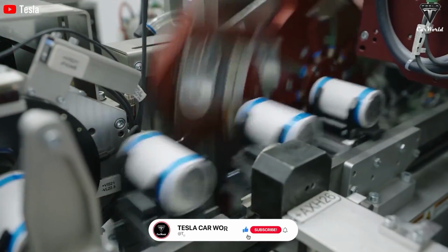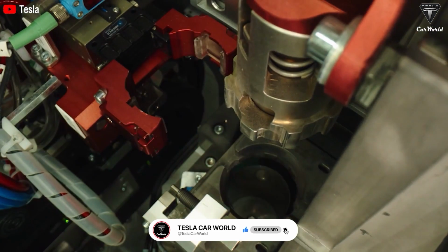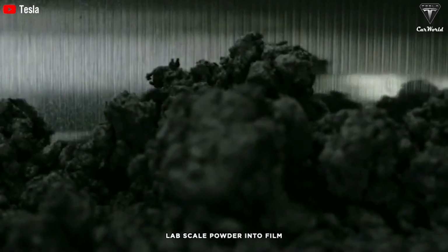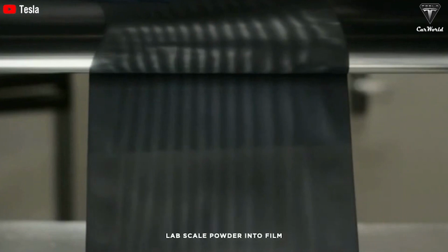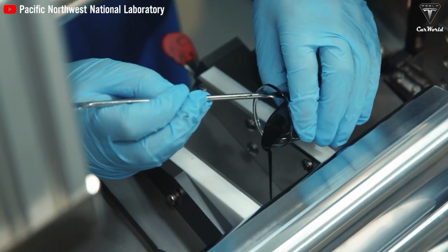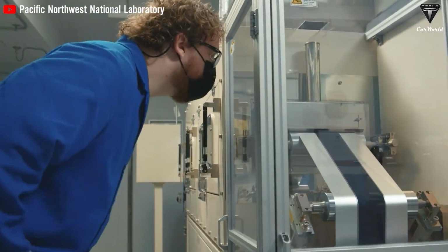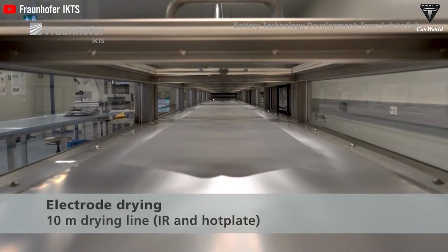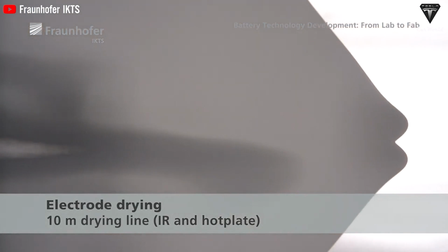However, traditional wet processes do not support the multi-layer design as easily as Tesla's dry process. Wet film formation processes, including spraying, slot die coating, extrusion, and printing, can limit the ability to combine active layers and face challenges in achieving uniform material dispersion. Additionally, wet processes are often costly and require time-consuming drying steps, and that can be problematic as the electrode film gets thicker, leading to limitations in the thickness of films produced using wet processes.